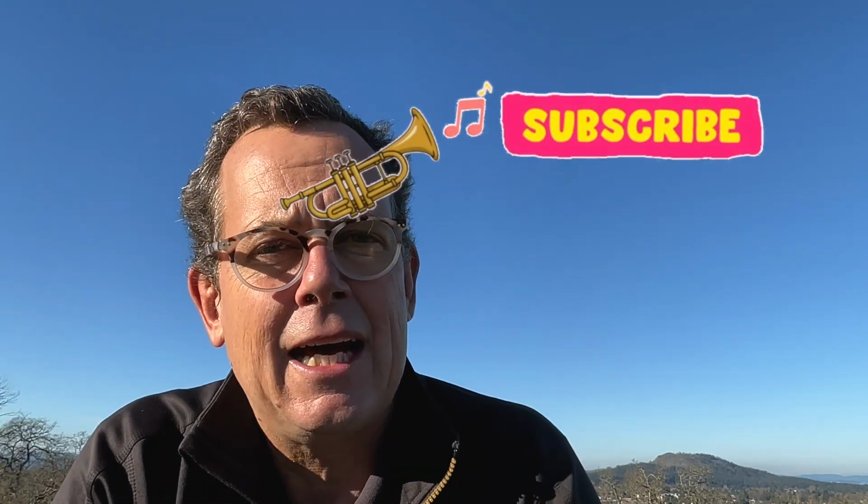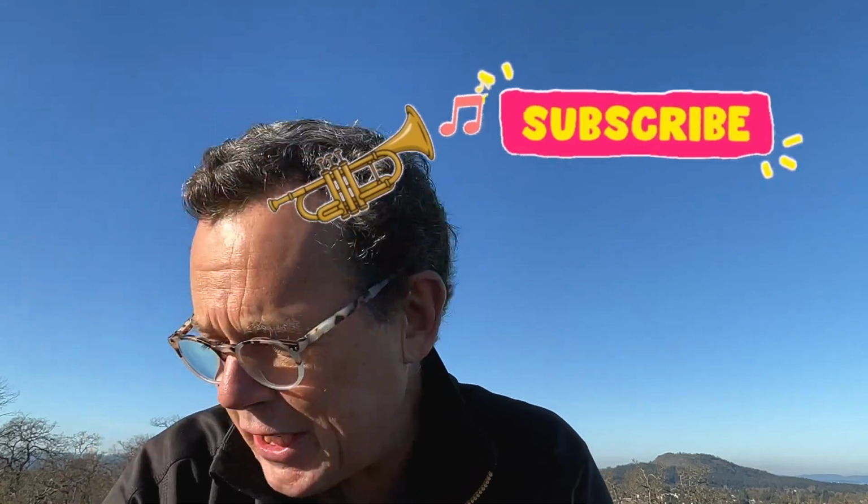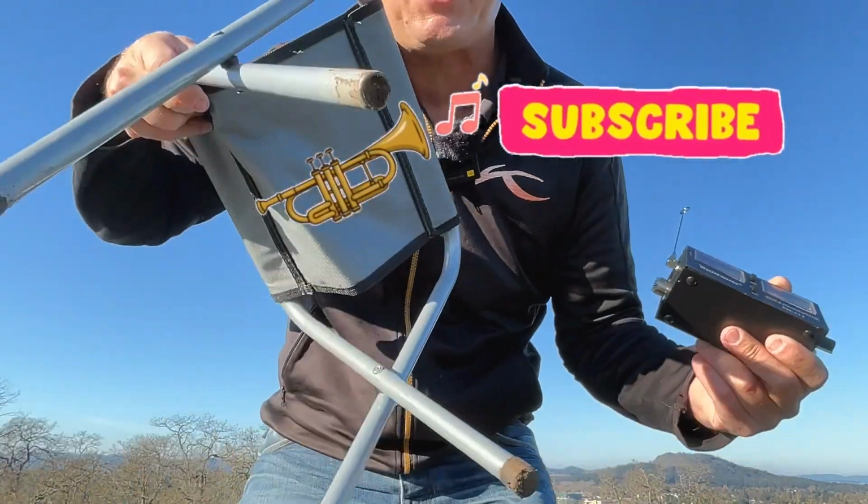I haven't brought the tape measure antenna today because I'm actually at a different park. I'm up at Mount Ptolemy Park here, and I'm sitting on my little bench here. But I'm going to make this video quite short today, guys. What we're going to do is I'm going to transmit. I've got the antenna on 10 meters. I've got it set up, I've got the SWR 1-to-1, so we've got no problem.